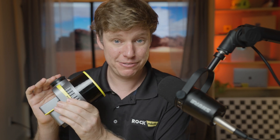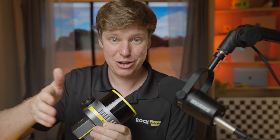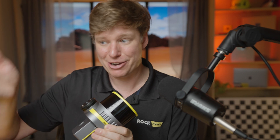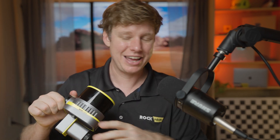We also have the ROCK Pilot app, which when you use this system with the DJI M300 — and soon the M350 — you're able to fly the whole mission plan and see the LiDAR data in real time. It'll take off, do the calibration, and land. DJI released a new SDK when they released the M350, which threw a wrench in the system. We had to update everything — it's been a big pain, but we're working on it and it's almost out.